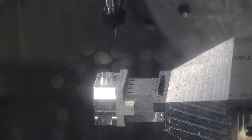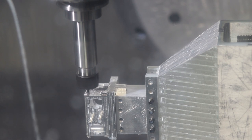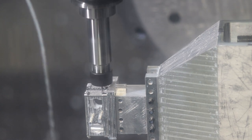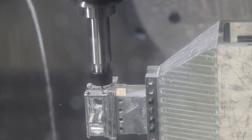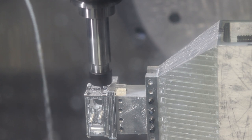Now we're going to deburr the tip here. Which is also another round raster pattern. So there's a faceted angled face that dumps into the bottom flat on the side of this part. So the easiest way to do it is to do this 3D raster, where we're just kind of scanning back and forth super fast and cutting an angled face that dumps into the bottom face. Otherwise, you've got to deal with tool blend issues again. And this is a small run part.